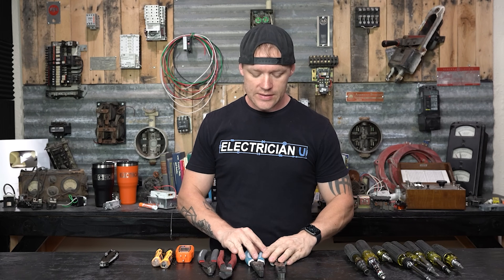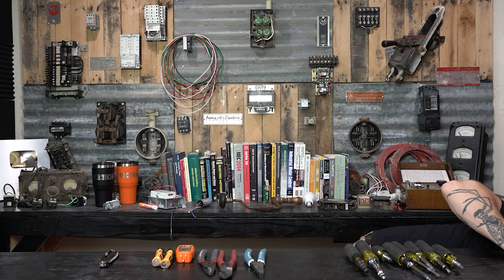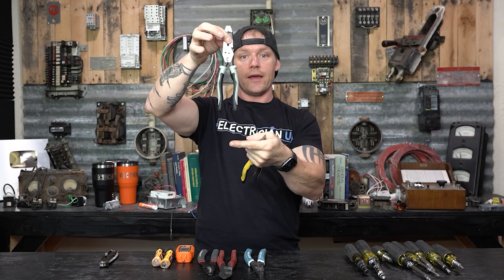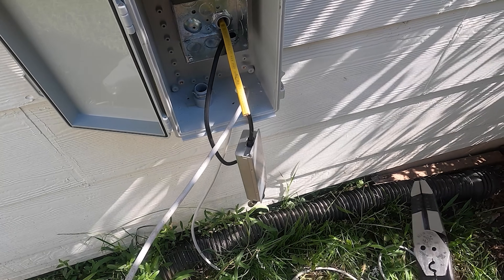There are two different kinds of what I guess you could call lineman's pliers, but they're combination. The first one has a short handle — just like a regular journeyman-style needle nose, the handles are the same size. Typically when you get a pair of lineman's pliers you're going to have long handles, and they do that so you get a higher amount of leverage and it's easier to cut because your hands are way down here. The downfall of these is that your hand is so far forward toward the pivot point, so it's harder to cut through things — you can't usually get through as thick of material as easily as you would with high leverage.